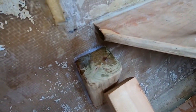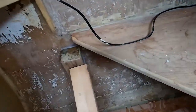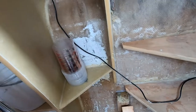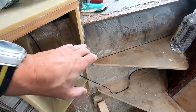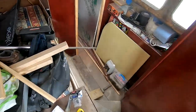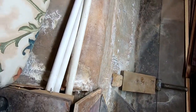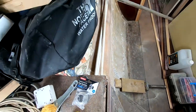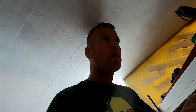This one's got a little bit of fillet on it, got some excess epoxy on, but the main aim right now is just to hold it in place, let it sit on there, and then I can get on and do the filleting. There are areas that aren't filleted yet but I don't want to keep pushing it around - I just want it on there and set, then I'll come back and put some thicker fillets on and tab it in as well, make it uber solid so you can hang a grown man on it. Just a block epoxied on, and then when it's gone off I can start putting heavier fillets and tabs on and get those stripper poles in.